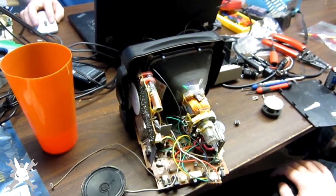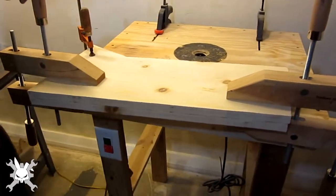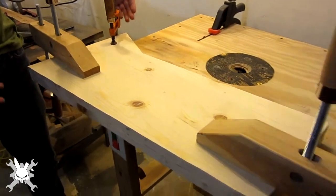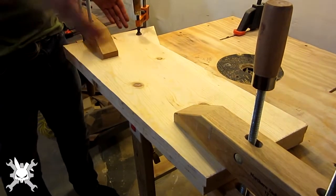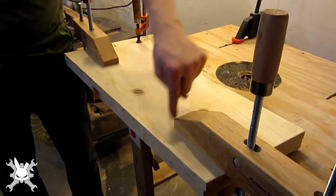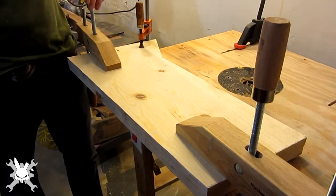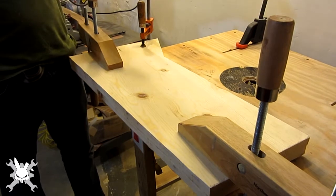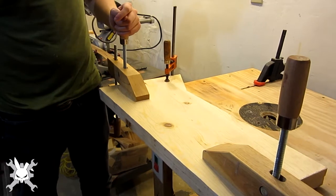We'll see. Excellent. You want to tell me what you're doing? Sure. So I'm making a shoe rack, and what I did was I just took a 4 foot by 1 foot board, and then I sawed it in half lengthwise, and then I sawed out this and this. And what I'm going to do is drill a bunch of holes, just like that. I already have dowels cut to length, so I'm just going to drill the holes the same diameter as the dowels. Stick both sides together with glue, let it set up, and that will be the project.